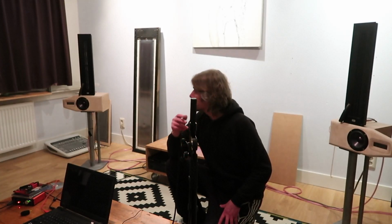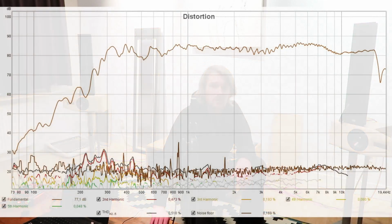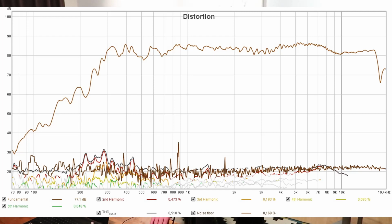Yeah, it's, you know, these filters, and I used a notch filter at 7.5 kilohertz, 5 dB down and a Q of 1 that will flatten out the hump you get. And this hump is also in the original measurement, although flattened, of course. But I assume it's the magnet array itself.